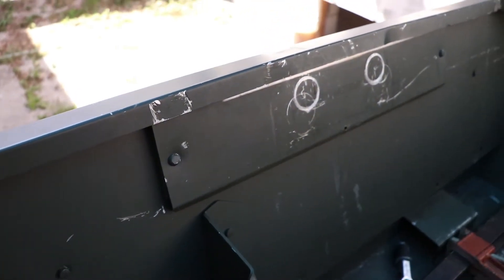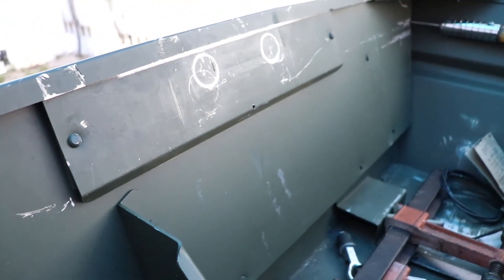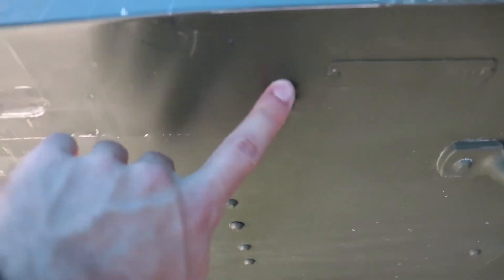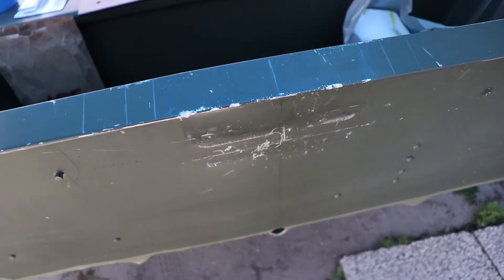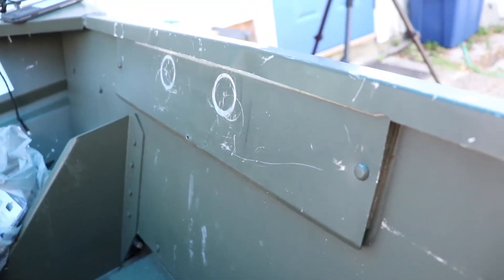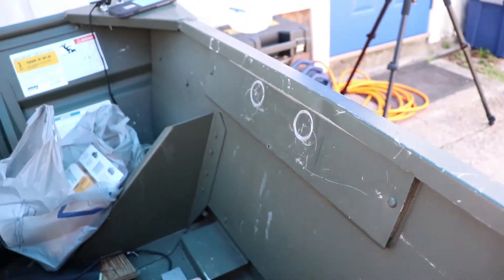That's what I would call the buffer plate right here — it's different from the rest of it. It's just those two rivets holding it on, one here and one here. Those are the only two we've got to remove, because I don't want this in the way — it's almost too thick and I really don't need it. I'm going to go ahead and fill those in with a quarter inch bolt, which should fit in that hole without drilling it out.